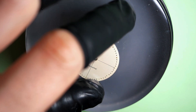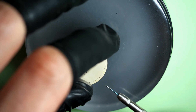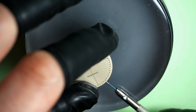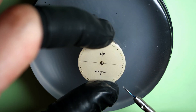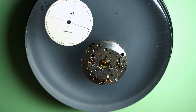You saw it came by the front and not the back, so I need to remove the glass in order to remove the movement. Now we remove the dial by removing the screws — there are two screws holding the feet of the dial. When the screws are done, we can gently push the dial up and it comes out. You can see the back of the mechanism; it looks pretty standard, very industrial.